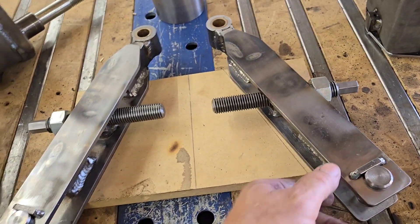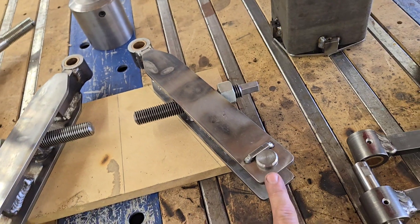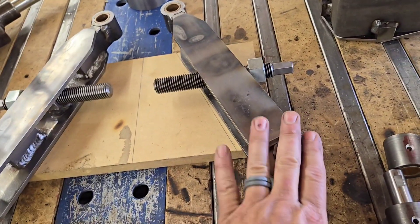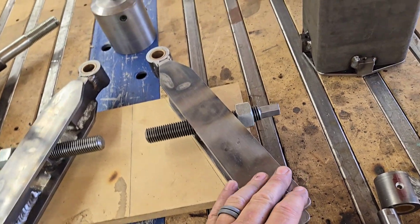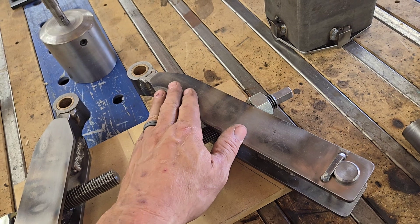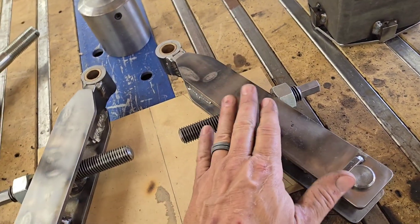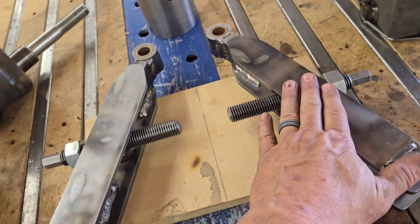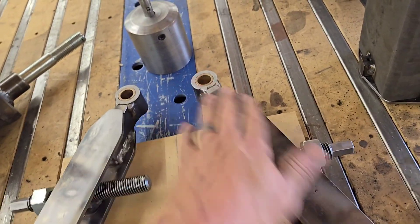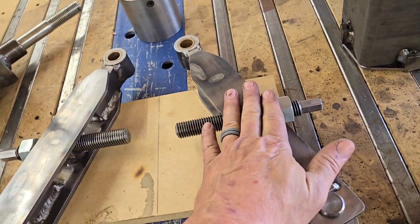When I had the four side plates, I went ahead and lined them all up together and gang drilled them so everything would be in exactly the same place on both pieces. All I had to do was get the first piece done as close as I could — clamp it, double-check the measurements — and then I was able to put the newer pieces on top, line them up with pins through the holes, and know everything was going to be exactly the same.